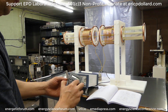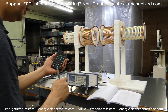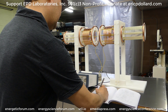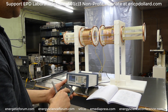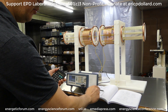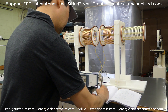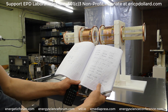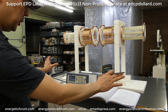We're going to get the calculator and look at the entire spread between the upper and lower: 5680 minus the lower 5670. That's 10 kilocycles, so the bandwidth is 10 kilocycles. Then we divide the resonant frequency of 5674 kilocycles by the bandwidth of 10 kilocycles, and we get a multiplication factor of 567.4. Eric had previously measured 568, and we're at 567.4 — essentially the same exact numbers. We just wanted to get this on video to show what it is with the ground plane.